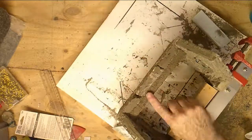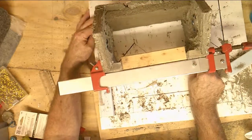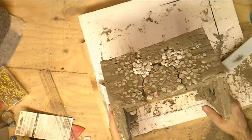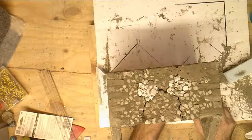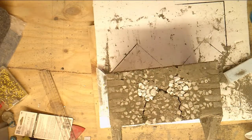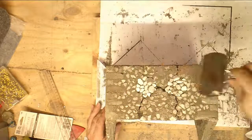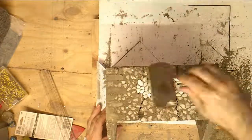There, you can see my double wall. Now comes the scary part — I have to take off the clamp and roll it over. This is the most fragile move of any pour, and with what happened with the wall, I was holding my breath. This is what the wall looks like when it's green and raw. Looks like it's going to be alright. You need to remove the concrete now while it is in the green stage. I really did not like working on this while it was still green, but it is a necessary thing. Here I am using the dog brush again, but not with a whole lot of pressure.